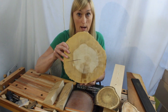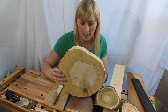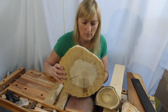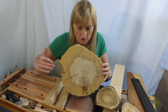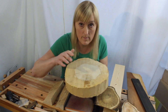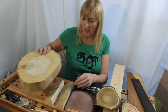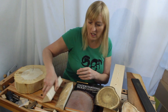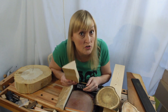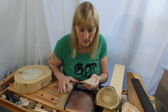This is a useful example because it shows just how much sapwood there can be. What you find is that in fast growing trees — usually broadleaf trees — they need a lot of moisture, a lot of sap, a lot of nutrients to grow. So there is proportionally a much higher amount of sapwood. In species such as maple, it's nearly all sapwood. In fact, the heartwood tends to get thrown away — what little heartwood there is.